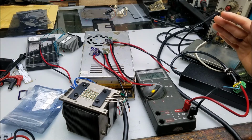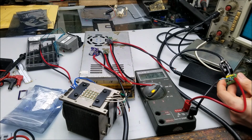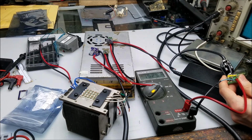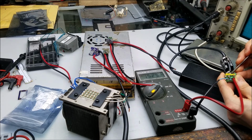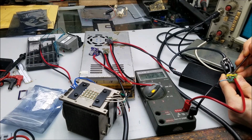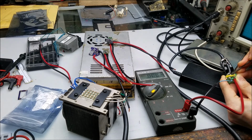So the next thing that I did to test that was just to simply short out the power supply and see how the recovery was. So I'm going to look for a swing that's over 16 volts on recovery. So short it out. The good switch mode power supplies typically can handle this kind of abuse. Recovers right back to 15.25. Do it again. Recovers right back to 15.25.